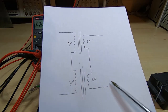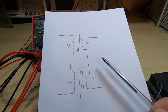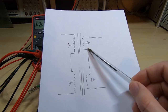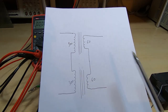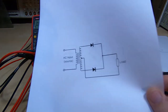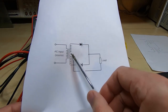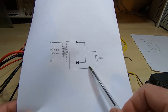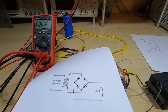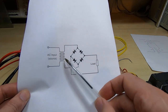This particular arrangement throws up a couple of questions. If we simplify this and assume it's a single transformer, the two options we have are: a centre-tapped arrangement where the centre-tapped point is the negative for the load, or the arrangement I'm actually going to use, which is treating the two transformers as a single transformer.